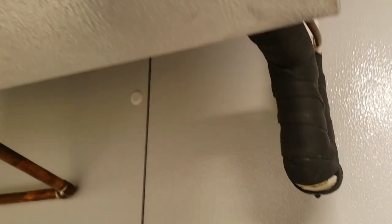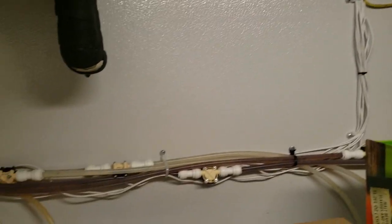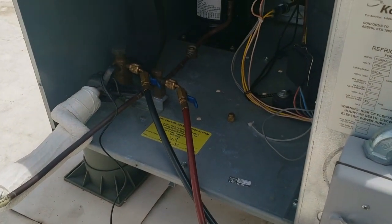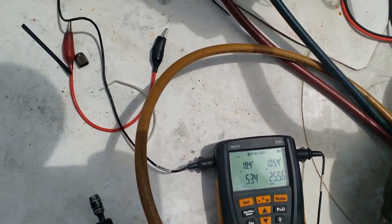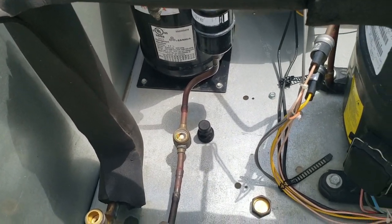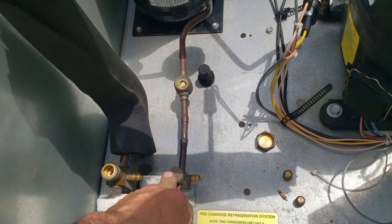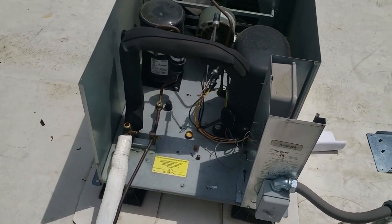It's coming down to temperature. May have to try to find a new valve - tried the local supply house and nothing matched up, so may have to call the manufacturer. Things look pretty normal; I'd like to see that TXV changed and the filter dryer changed and it should be good to go. Got one on the truck good for half-ton to one-ton. Got our pump down, service valve open, took the strainer out, valved it off to isolate our suction. We'll be able to purge nitrogen through the TXV when we braze it in and pull a vacuum at the suction port.